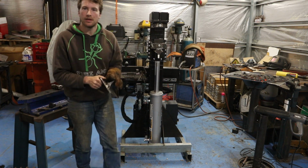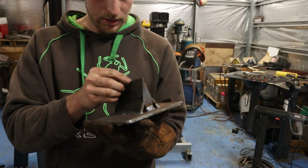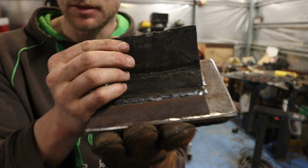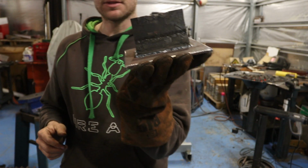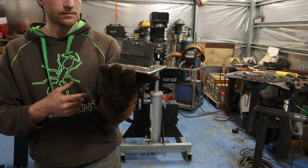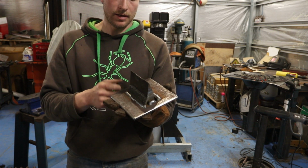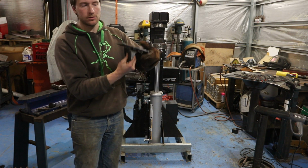And one that has been quite handy so far, although it's not really lasting too well. I've no idea what steel they used, but it's nothing. That's only a few cuts later and it's already doing that. But anyway, that's from the wedge. That's a part of the wedge that comes with the log splitter that we cut off. I've been using that for a hot cut, and we'll try and use it for a press brake as well, in between a few bits of angle.